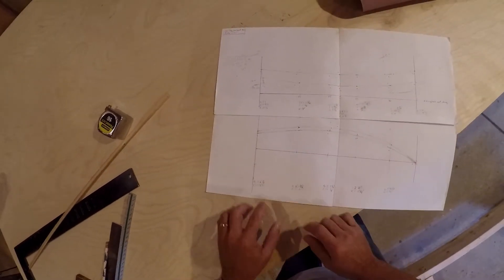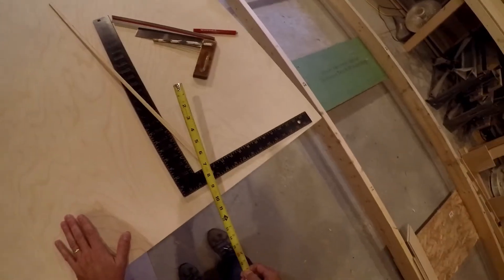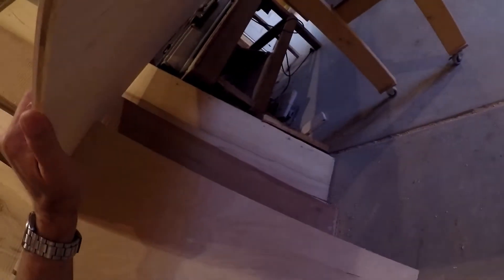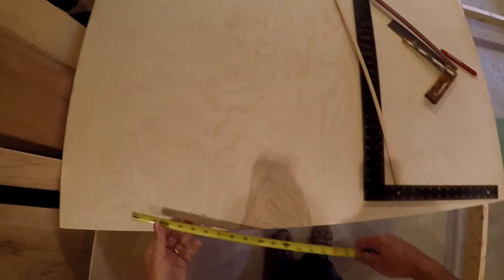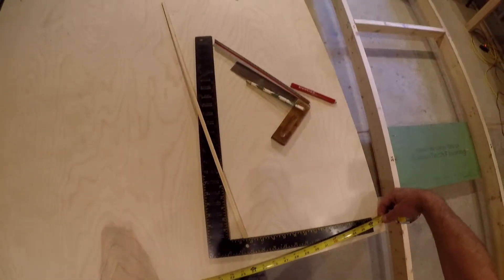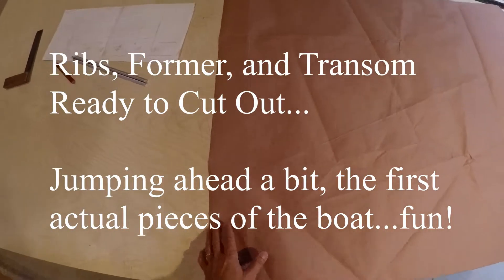The shear is one foot six inches times two, so we need three feet of run. We could do it across the end of the piece of plywood, but this is a natural wood finished boat, so we're going to see this grain. Choosing what kind of wood we want to see here is important. This is the back side — still pretty, this birch plywood is beautiful — but it's got more little bits of knots and things. This is the pretty side, the A side. I don't want that little dark spot in the middle of the transom, so I think what I want to do is take the transom this way. Ready to start cutting out this plywood for the first time, making something that would be part of the boat.